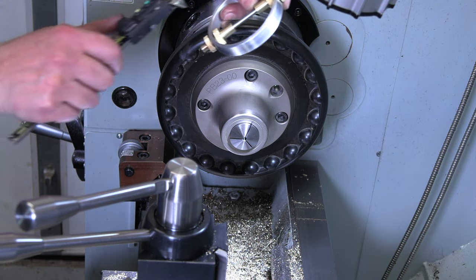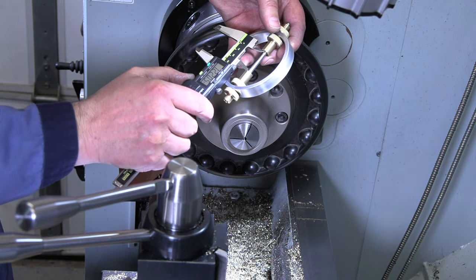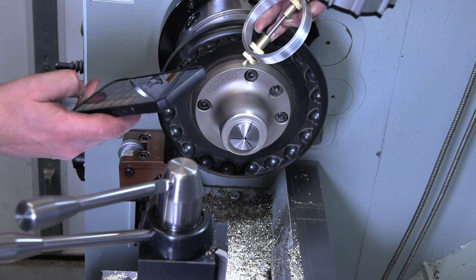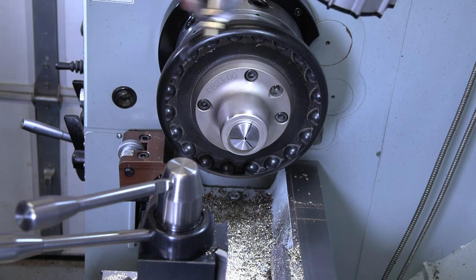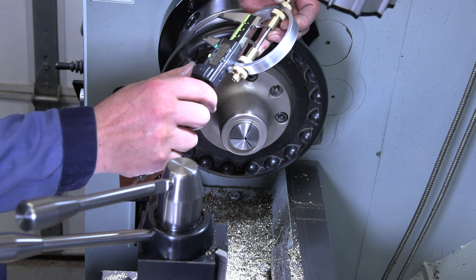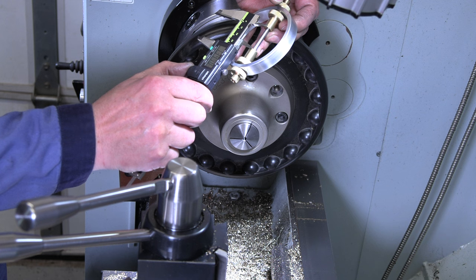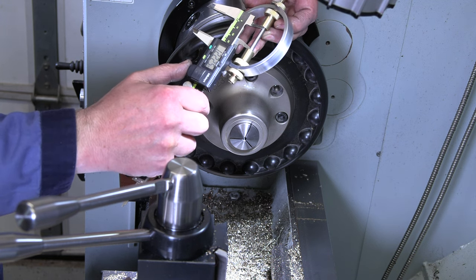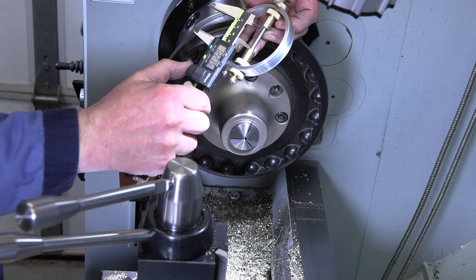Make sure my spacers are wide enough. So we're looking at 1.221, 1.222 in there. 1.375 is the total width. So my spacers are plenty long. Yeah, I'll be taking almost 1/8 of an inch off of those. I mean, actually, I left them 50 long. I went 60, so I left them each 50 long, so that's 100 thou.